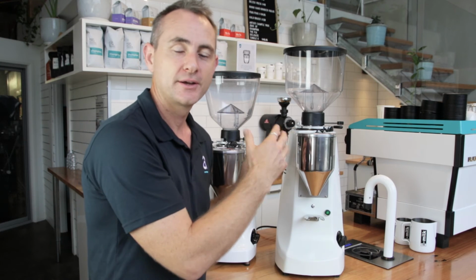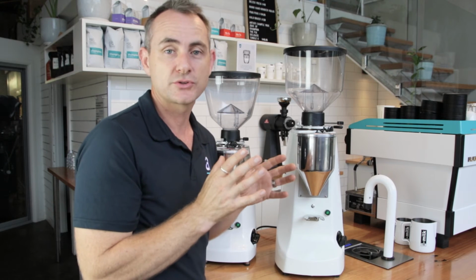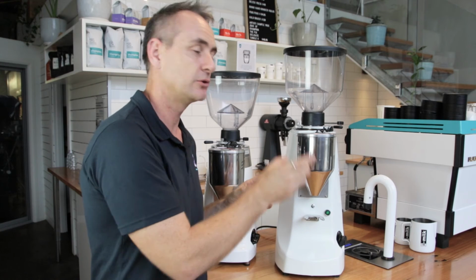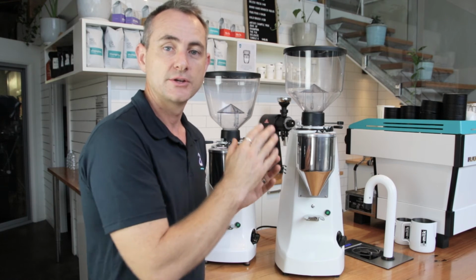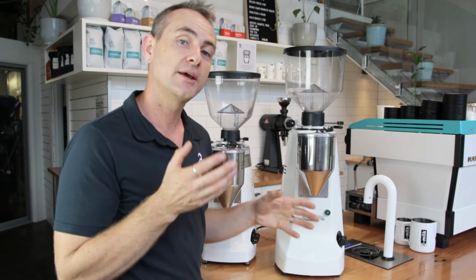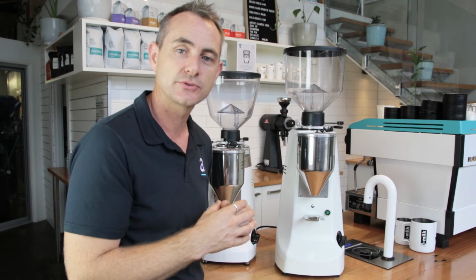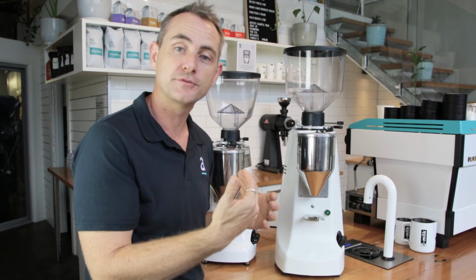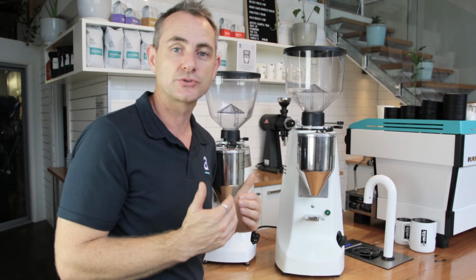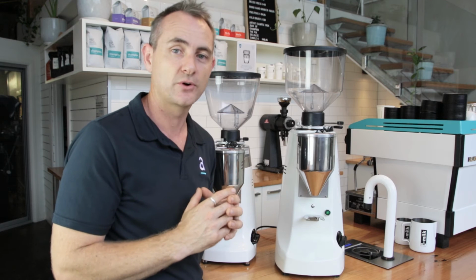So inside the grinder, in the grinding chamber, as it's coming out, you can get a long sausage of grind that's going to be retained and held back until you do your next dose. So if that falls into the next preset amount of time, you can get a gram or a gram and a half at least of coffee added to your next dose. Or if all the coffee falls out and you grind again, you'll actually have an underdose of coffee when you press the time. And you can be up to 2 grams difference in these grinders.